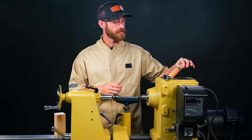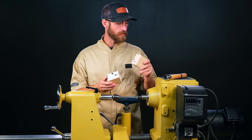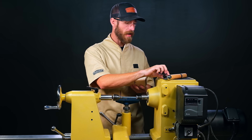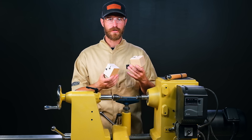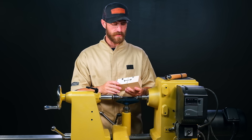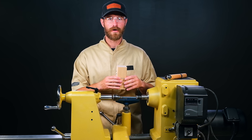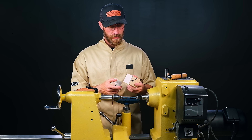When turning our cigar case, the first thing we need to do is get our blanks prepped. I have a couple pieces of figured maple here and I've cut these a little bit shorter. I want to make my cigar case to fit more of a Robusto or a Corona sized cigar, so I've cut my tube down and shortened it by about half. This figured maple is exceptionally dry — when doing this kit you want to make sure your material is either stabilized or really dry, because it has a pretty thin wall thickness once finished and it will crack and split if it's wet. So make sure your wood is nice and dry and a nice hard wood that'll hold up to abuse and carrying around in your pocket. I've already got my center marks punched, so let's get these on the lathe.